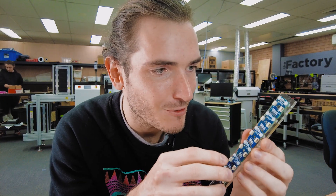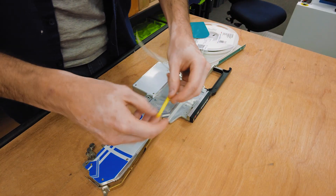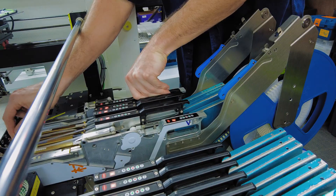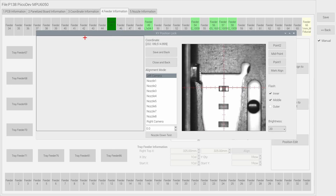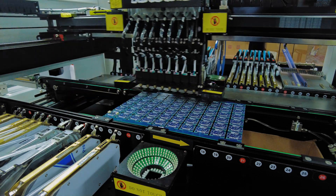It turns out that the micro electromechanical machine inside this device needs a significantly higher voltage than the standard 3.3 volt supply, and so it does that boosting internally. So I got those components loaded, aligned, did a dry placement to make sure that everything went down okay, and then began the assembly.